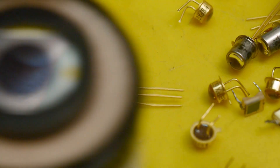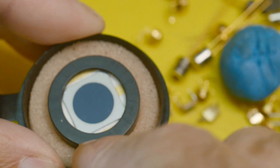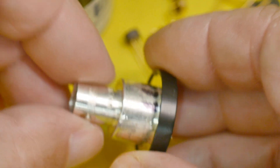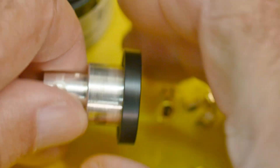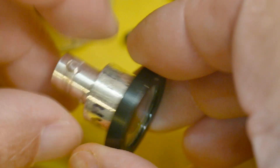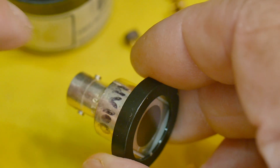I'll show you a couple other ones. This is a big one-centimeter-diameter photodiode on a BNC connector, so you can buy them packaged up. A clear one like this is what's called radiometric — it's just a photodiode output current depending on how much light comes in. It's amps per watt: how many amps you get for how many watts of light, and the datasheet will tell you how many amps per watt a particular diode will produce.